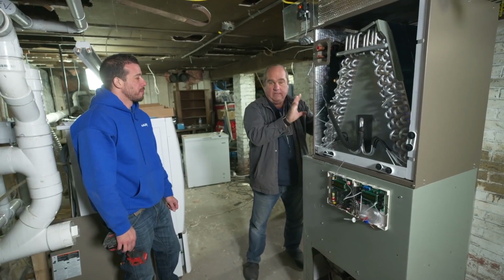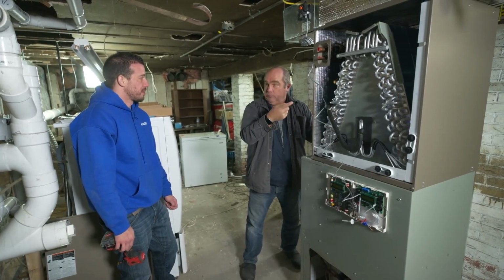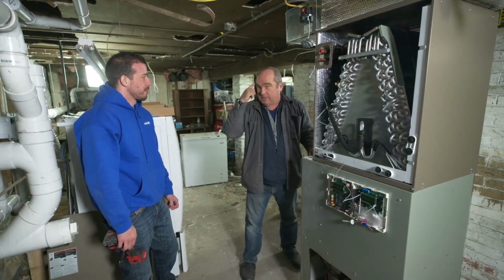But what makes it different is that before this came around, if you wanted to add a heat pump coil to an existing furnace, you'd have to go to the manufacturer and get their unit that would be matched up to it. So the fan would be on full, and it just worked as a tandem. With this, it doesn't really care what's below it. It's smart enough to modulate just the right amount of output based on what's inside its brain out there.